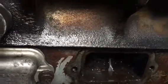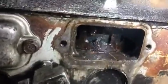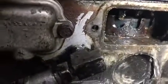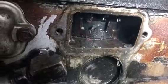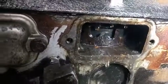This is the inspection hole cover — you can see water coming right out of there as soon as I took it off. Jeff, hand me that flashlight please. Get some light in this little hole here. Look at that liner — you can see what's going on. That liner is completely broken in half and kind of twisted around. It's definitely down that cylinder. Look at all that water coming out of there — that's crazy.